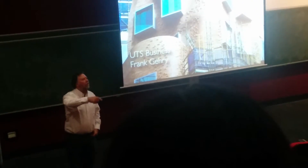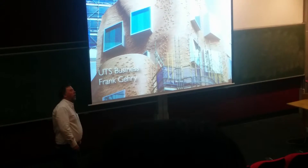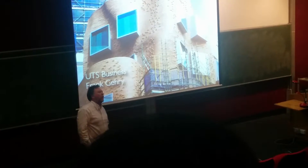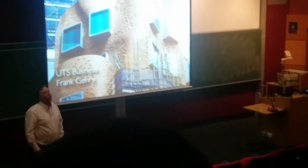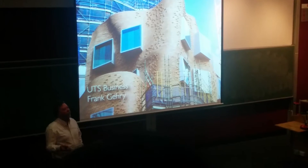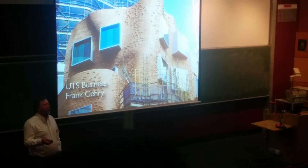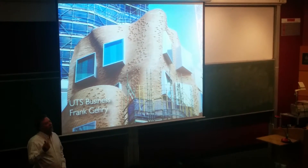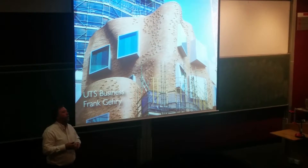I don't know if it's going to seal a lot. If it's a design joint, and it's good quality silicone, and it's not contaminated on the sides, and it's all done properly, you can protect it from UV for maybe 20 years. But just about none of those things ever apply. The problem with silicone joints is that they generally end up in the wrong proportions, the silicone is contaminated at the time it's injected into the joint, the adhesion to the substrate isn't that great, and eventually the UV will get it. So the real answer is probably near a 10-year service life.